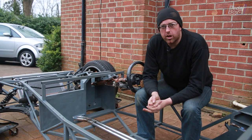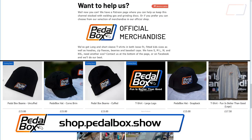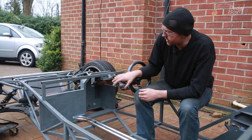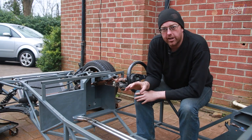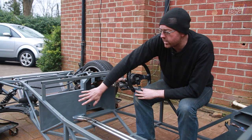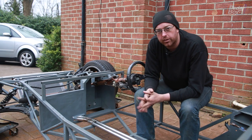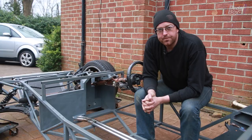Thanks very much for watching. If you'd like to subscribe to the channel, that'd be great — also leave a comment below and like the video. Check out merch including stickers, hats, t-shirts and more at shop.pedalbox.show, and if you'd like to support the builds directly you can go to patreon.com/pedalboxshow. It's been a pretty successful episode getting the accelerator pedal into the pedal box and closing these two areas off, but we've definitely learned that we've been doing panels wrong — we should be creating flanges to weld onto our structure rather than seaming around the edge. A few bits still need tidying up but the compressor's broken on us, so once we sort that we can get the die grinder in and tidy up a couple of the corners.